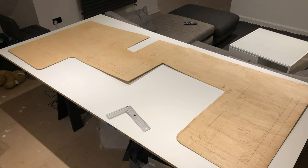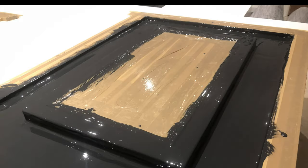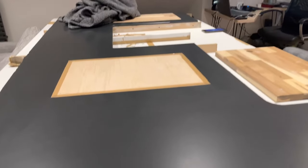Meanwhile, working in parallel at home, I made up the mould for a new worktop. I used 18mm melamine-faced MDF for the mould face, along with battens, mould release tape, and a wax filleting kit to build the mould from the template we had made. I also threw in an Ikea chopping board for a fridge lid. The worktop got laminated up in polyester gel coat and resin for simplicity, low cost, and ease of any future repairs if needed.